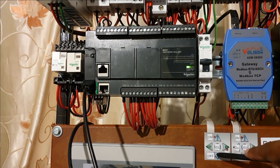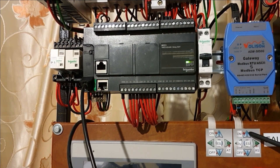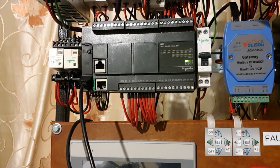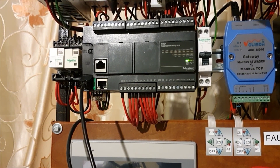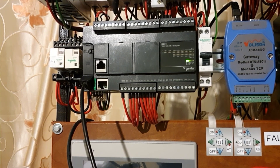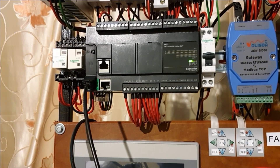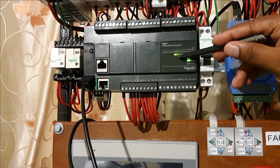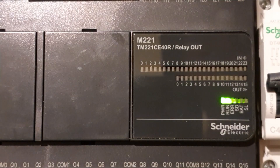Here you have the ON switch, and here is the OFF switch. This will be used for the SR — this will be the SET and this will be the RESET. These signals are connected directly to the inputs here. I am using the command and the different inputs — input 1 to input 4. As you can see, if I press ON, the signal is activated here. I have already wired the different input simulation switches.